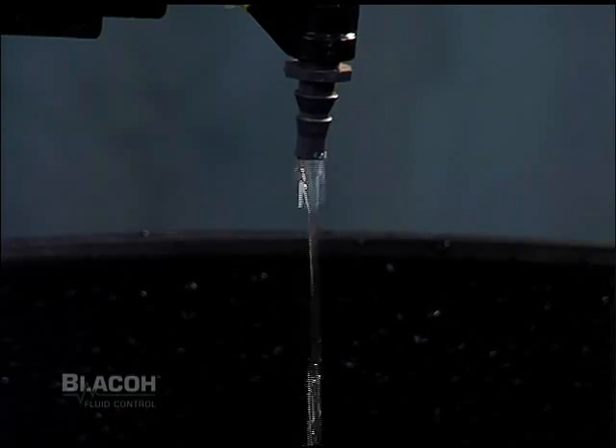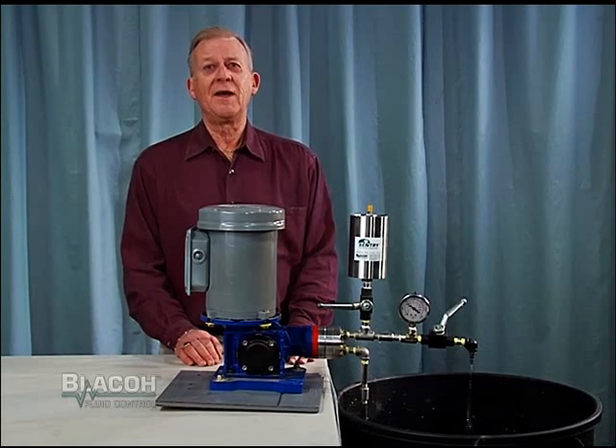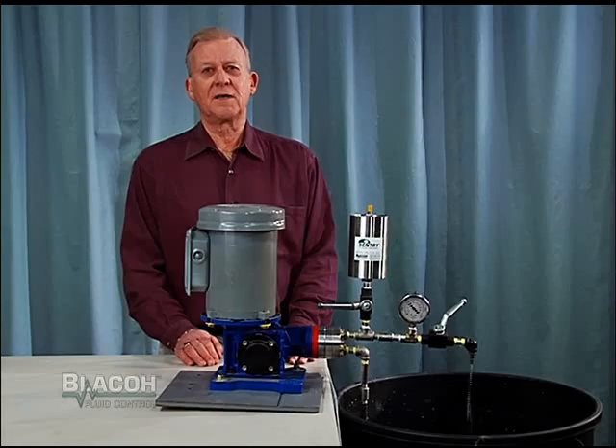With the dampener isolating, it can be observed that pressure pulsations are rapid and pressure fluctuations on the pressure gauge are so rapid they can hardly be observed. These rapid pulses can quickly crack discharge tubing and prevent even injection of chemicals such as in oil field applications.